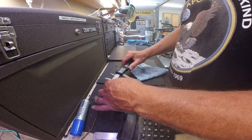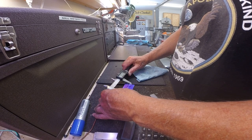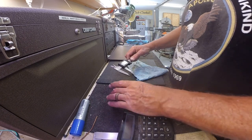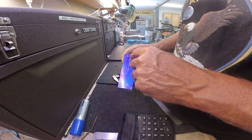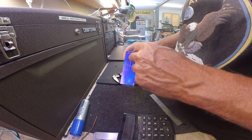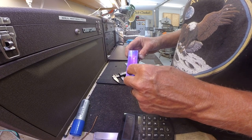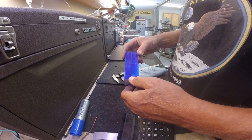All right, let's mark this. I'm going to come in. Let's go halfway. It's 4.5, so 2.25. Cut it there. Let's go back to the 0.75. Just extend that cut line. Okay, so we're going to drill a 1-inch hole here, then we'll split it there, cut it there, so that the bottom piece with the half circle in it can clamp, and the kerf will provide the clearance, and then we'll do the 15/16 hole right through here. Okay. We'll come back when we get set back up on the mill.